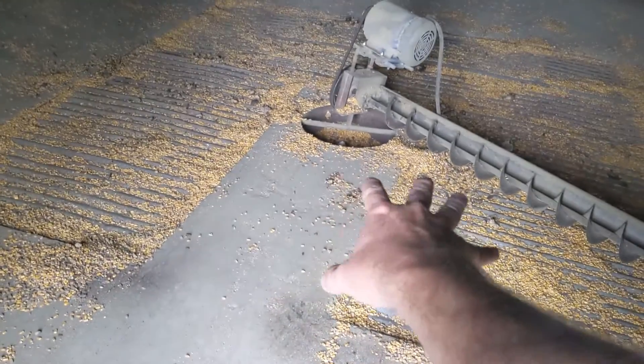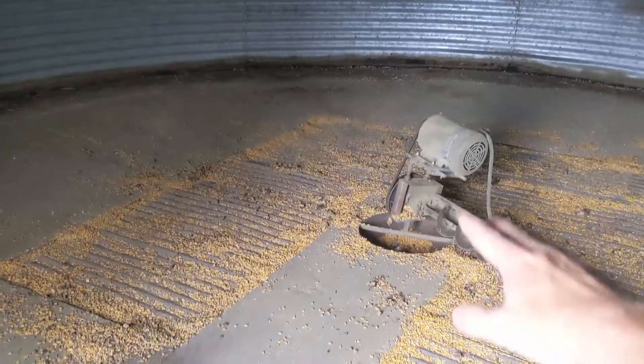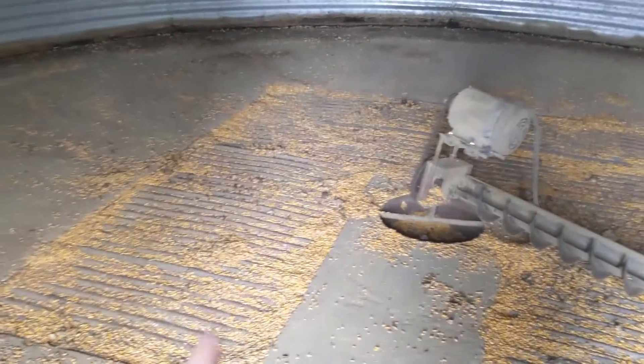This bin is a little different - concrete floor here, aeration floor here. I thought about putting an aeration floor in the whole thing, but then you have the unload that probably comes on top of the concrete. That air is probably not going to do a great job getting out to the edge. This area back here is kind of always wet - there's always some rotten junk there.